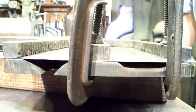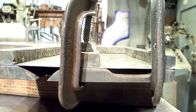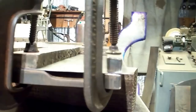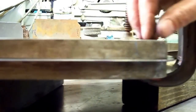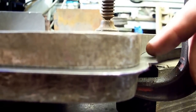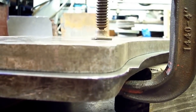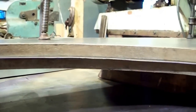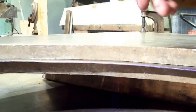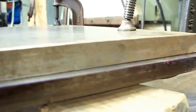Here's our sheet metal sandwiched between the two hammer forms. I got it up on four by four blocks, everything's lined up perfectly, and it's clamped down real tight so it can't move. As you come around the corner here you can see a real tight radius in this area. On an original body tub you'll see how they handled it - they cut some material out and came real sharp around here. That's a detail on all original jeeps. We're going to have a nice even flange going through here, approximately three-quarters of an inch, bent down nice and even.